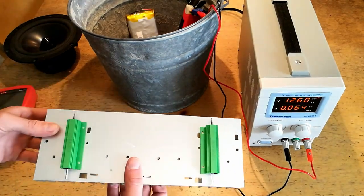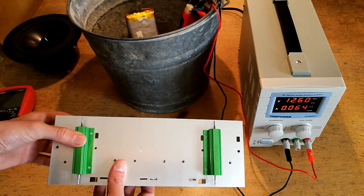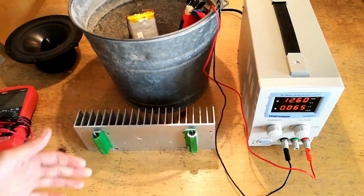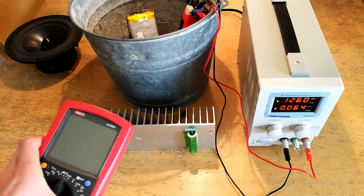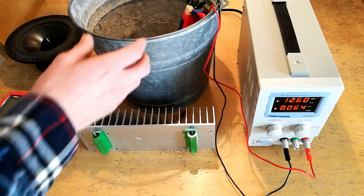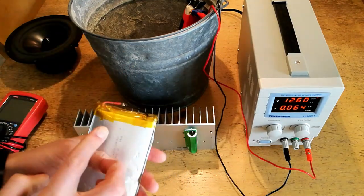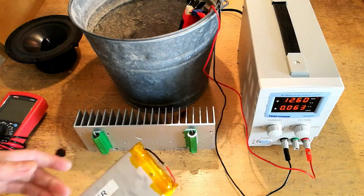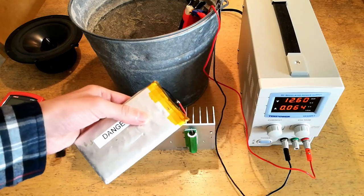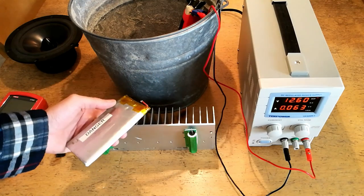What you do is connect the desired resistor value across the output terminals of the battery and allow that to gradually discharge the cell or pack until the voltage reads 0 volts with a multimeter. One important thing to note is this only works well on batteries that are unprotected, where the wires go directly into the cell and there's no protection circuitry on the pack. If your battery has protective circuitry, it will turn off the discharging at 2.5 volts — just like the 0% state of charge meter would indicate — and it will not allow you to fully discharge the battery.